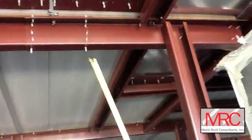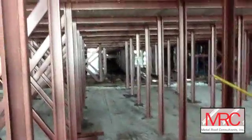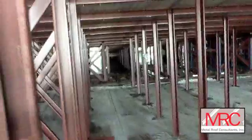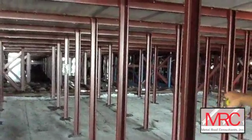On an 80-degree day today, it's probably 70 to 75 degrees under here. This panel has a reflective surface — it's a dark blue panel but with a ceramic reflective surface that reflects 80 to 85 percent of the sun's rays, keeping the panel very cool and the space well-conditioned. You can see in the distance where we've put six inches of R19 insulation on top of the existing roof. Combined with the existing two inches of rigid insulation plus the built-up roof, adding R19 will considerably increase the thermal capacity of this roof system.